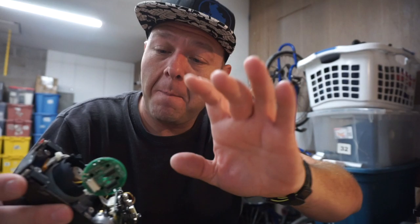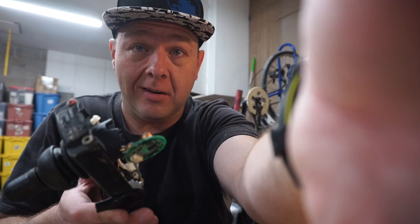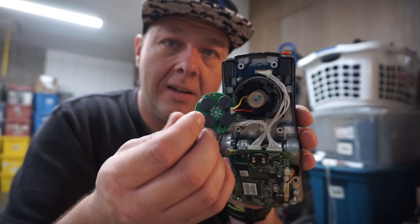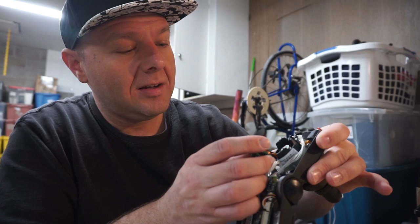The reason these break — the design is very skookum, but there's one glaring flaw. We have wires connecting the magnetic coil that moves around. I'll guarantee you that's the failure mode on these things — these wires become desoldered and then it won't move anymore. Essentially, this electromagnet moves around, changes the magnetic field being generated by the pickup coils, and the software on these little chips decodes that into a usable signal and sends it out to the chair's controller. The design is right on, but the implementation — not so much. These little wires are just getting flexed constantly every time you touch the joystick.